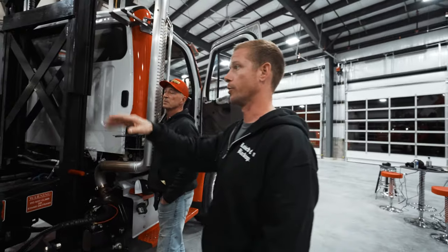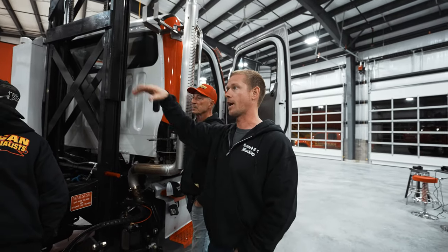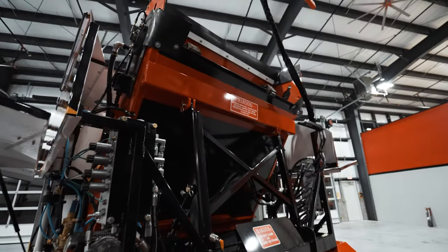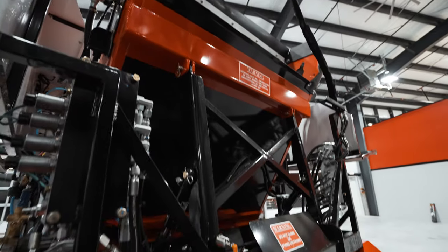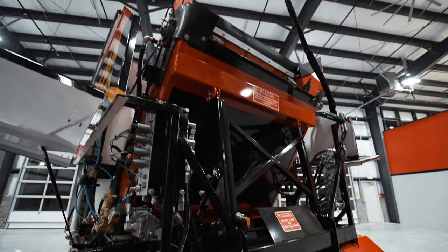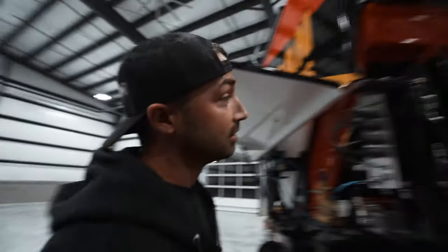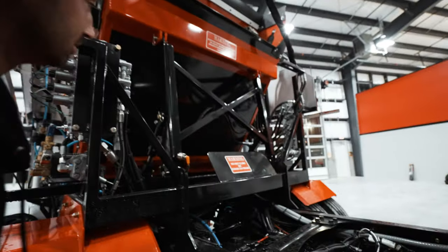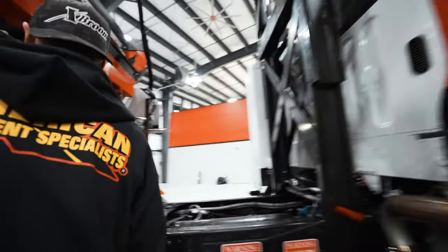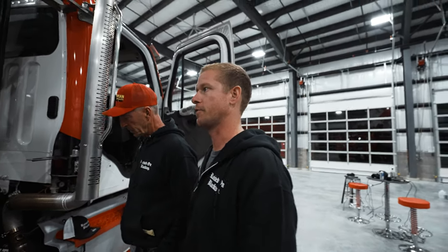So then this gives you a really good idea of how we set up the hydraulic manifolds and hydraulic lines and all that good stuff. All right there in the open. Easily accessible, it's easy to clean, it's easy to maintain. Simple. If you get a leak, you can get in there and tighten it and change a hose out easy, right? Yep. Right, yeah, all standard hoses. Female JIC hoses. So they're not O-ring face, O-ring boss, nothing like that. It's just simple standard stuff, stuff that you can find any place.